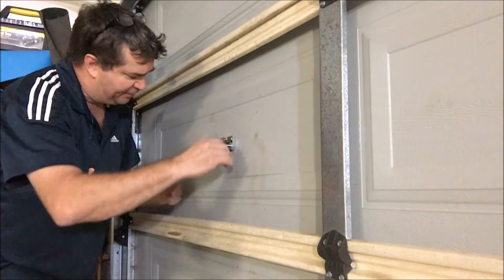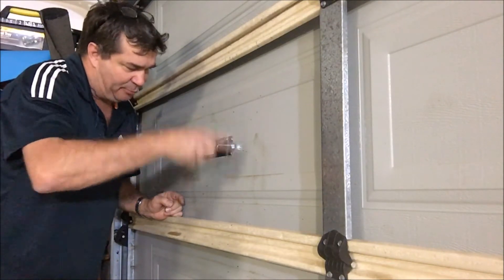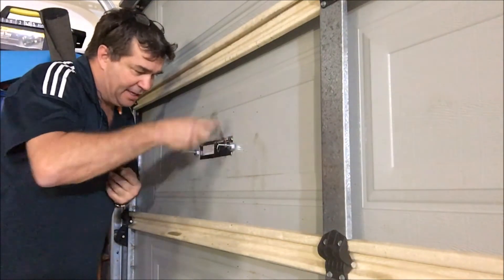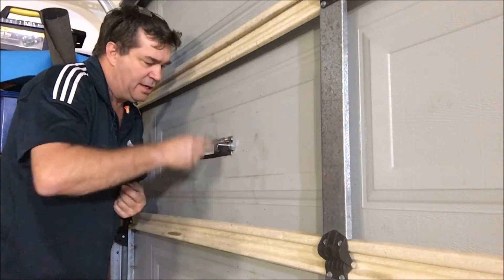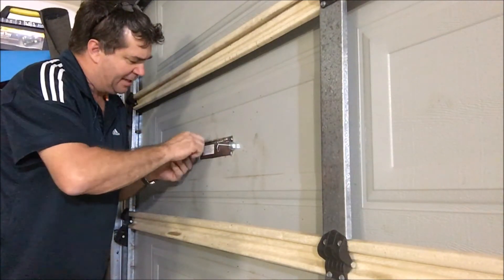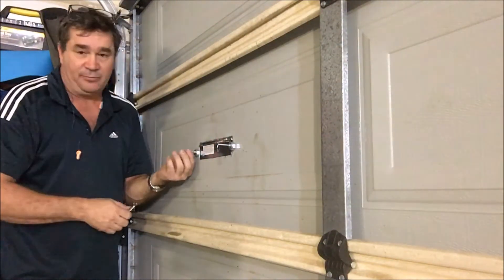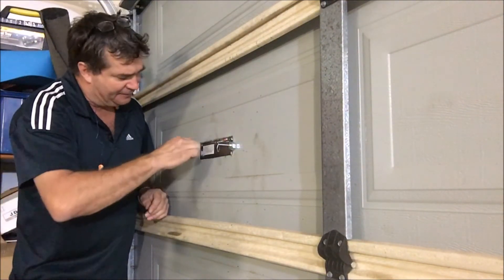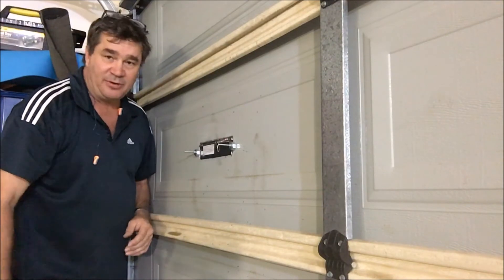I've put my pack of bolts on here and my washers, and I'm just going to tighten the nuts up without the box on, for two reasons: I want to pull the plate in nice and tight while the silicone sets, and also I want to get the nuts in here and cut the excess off these bolts — having the nuts on, I can wind them off and it will clean the threads up, making it nice and easy to fit everything up. I'll leave that sit for half an hour for the silicone to dry out.